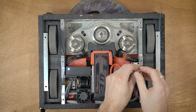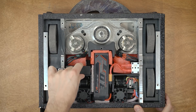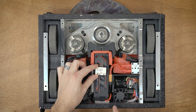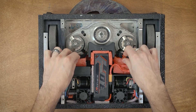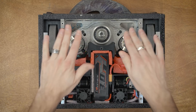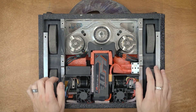So let's turn this off and start disassembling. I want to start by talking about the radio system which is underneath this little 3D printed block — just a simple PLA block I printed. The receiver I'm using is an FrSky X4R, which is a four channel receiver with telemetry built in. This current configuration doesn't have active telemetry, but I do have all the current sensors, voltage sensors, and temperature sensors, and I actually used them during testing quite a bit to determine how much power I needed for the weapon and the drive system.